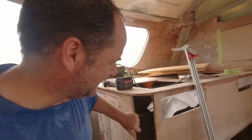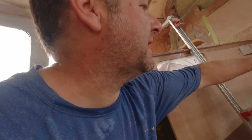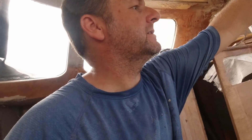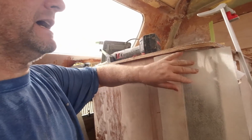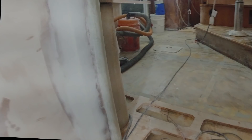The challenge for today is getting a curved corner on here. I've made a few attempts, including bending foam with heat. But one thing that works well is to make a flexible sheet, lay it up flat, then glue it around the corner to form the mold, then add more layers on top and core behind. After putting putty on it and final sanding, it turns out pretty good — really quick and easy to make nice corners.